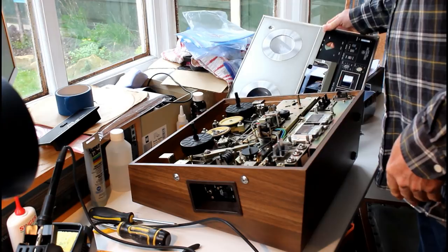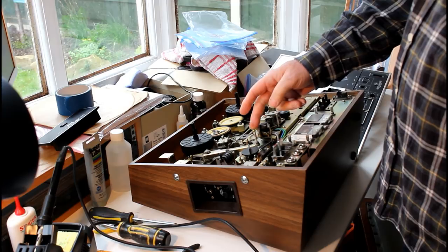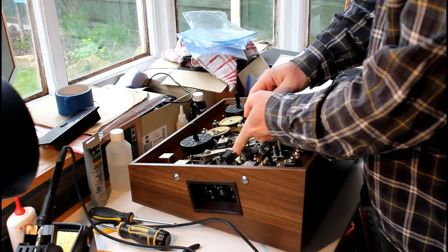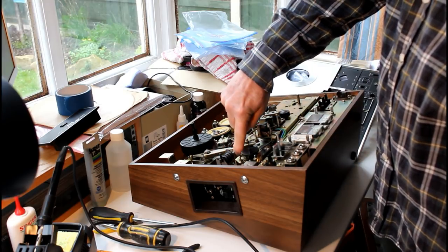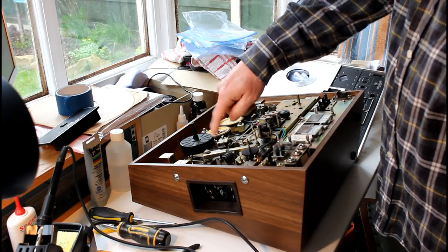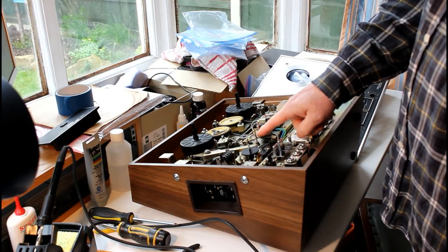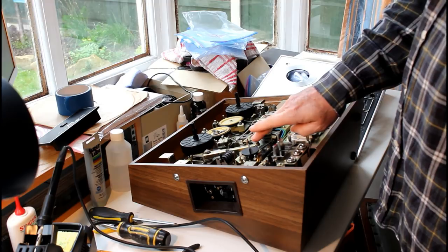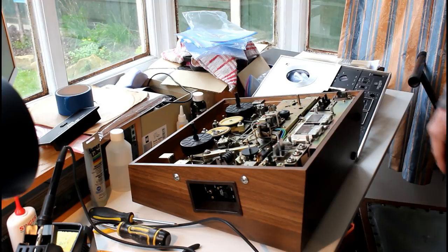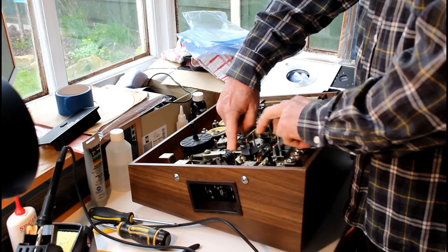And then the last thing to think about is this lever here. It has a little spring-loaded retaining rod here, just behind the counter. Sometimes if it's moved over like that, it gets on the wrong side of this spring-loaded retaining lever and it ends up like that, and then the machine won't work. There's just enough room for you to get the front on with it in that position, but the machine won't operate. So you've got to pull this to the side, move this lever out the way.